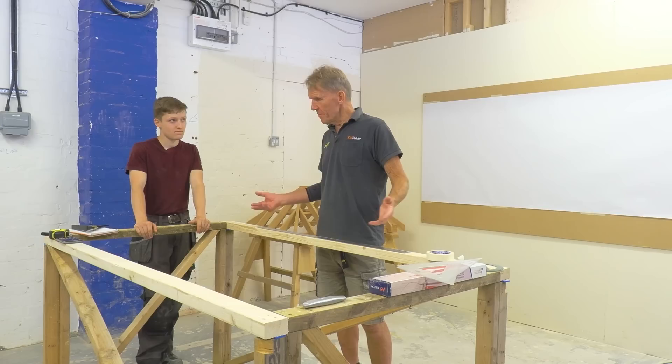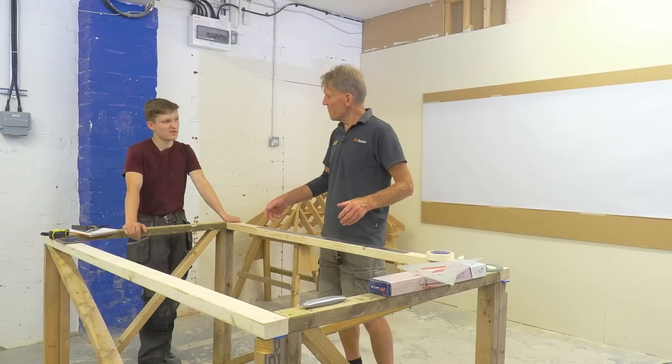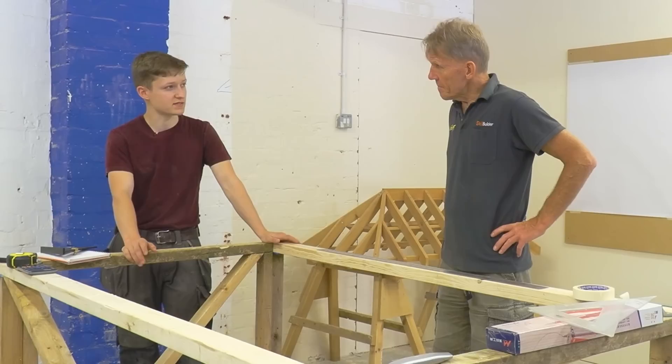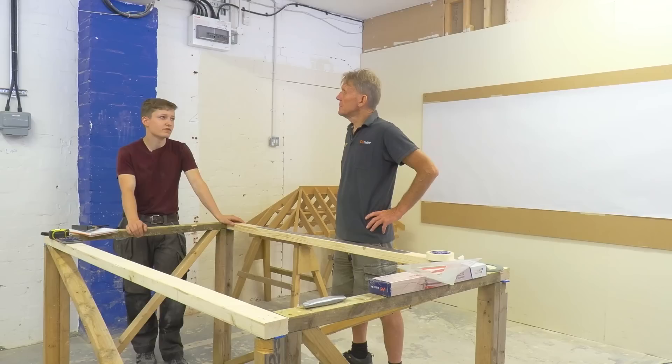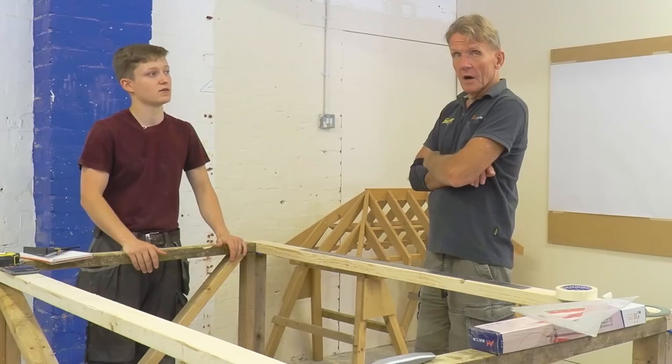This will basically be the wall plate - here are the walls. The first thing you want to do is check the dimensions, everything's parallel and square. You check the diagonals - that's where you start. When I was with Dan, I checked at the back and then stepped in to check exactly where the end common rafter was, because that's where all the geometry lies. On Dan's job there was a 20mm discrepancy - not massive, but enough to throw my geometry off.